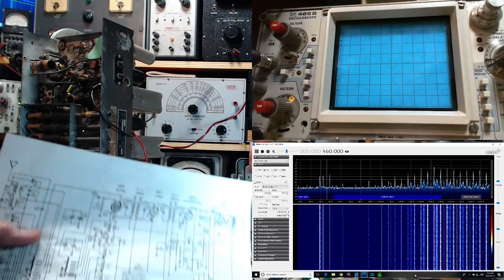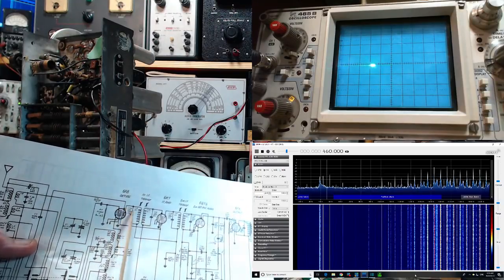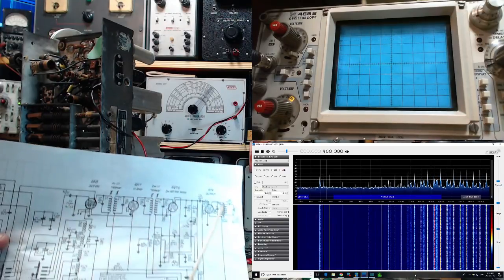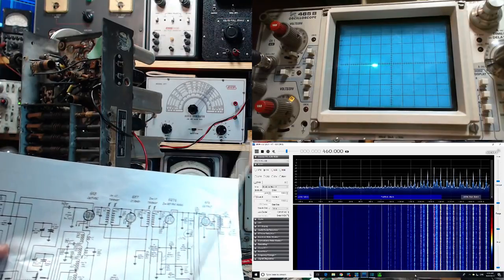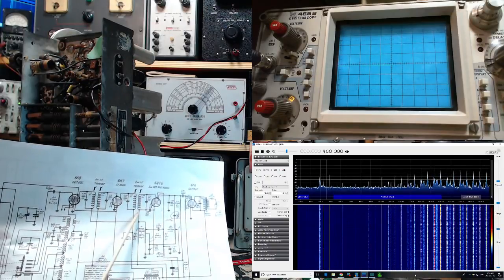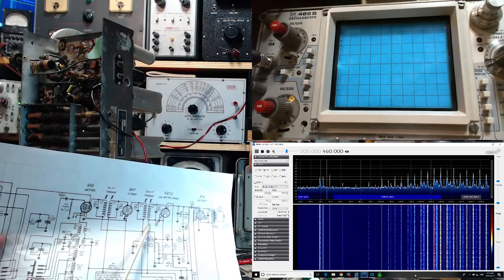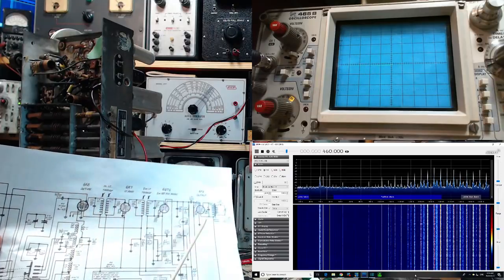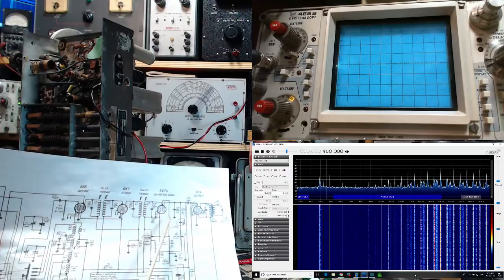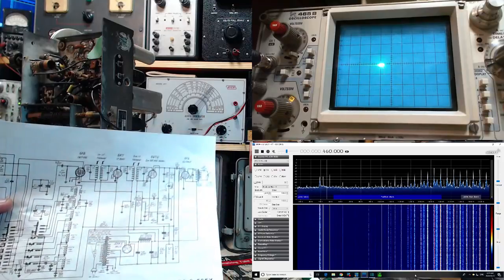So if a frequency of 460 is sitting here, it won't be suppressed, eaten away, shot to ground. Instead, it will look at this as if it's a great big resistor here. And so a larger voltage or signal will build up at the resonant point of this transformer. Now it seems to me if this transformer were way out of whack, you'd never know it up here. And that's why we were listening to the radio the whole time I was doing those studies. Ultimately, that's what this is all about — what this sounds like. I used a regular radio station because that's much better in my ear than a tone from a signal generator.